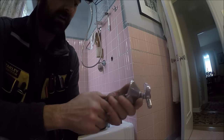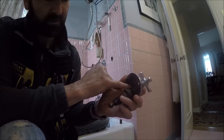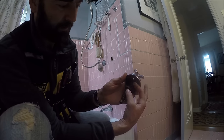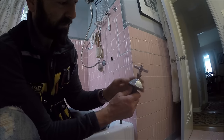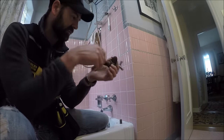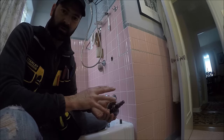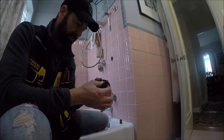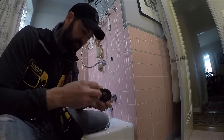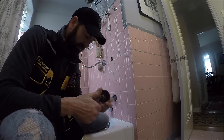The packing goes in here. And this first threaded piece that I unscrewed — if you snug that down, it pushes pressure on that packing and seals up around this stem more and more. But it's something that I should replace today while I have all this apart. I think we're going to first see what it would cost to replace the whole thing. That's what the homeowner specified. It's probably going to be a little bit on the expensive side, but I'll get a price and get in touch with them and see what they want to do.